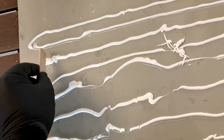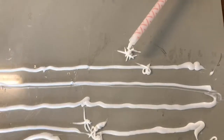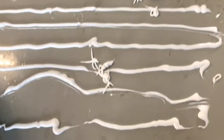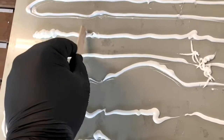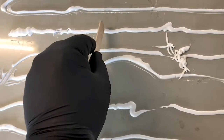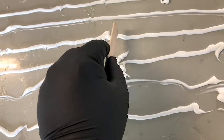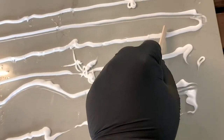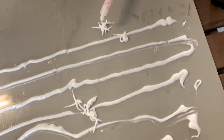And on the second bead, it's just starting to cure now. So that should be nicely set up in the tip, and we might go another go again. So you can see this is even patchy. I mean, that's rock hard there, and that's still liquid here. So this was pushing out through a partially blocked nozzle, and we'll do a third one now where the nozzle is really blocked, and we'll see how it goes.